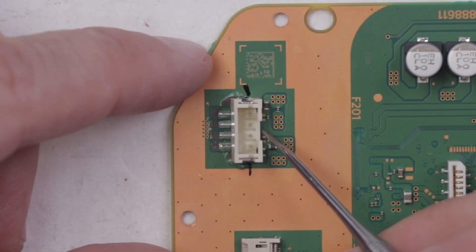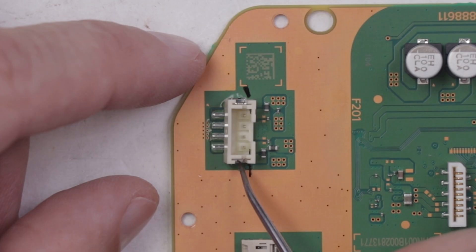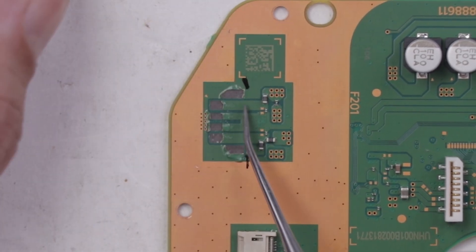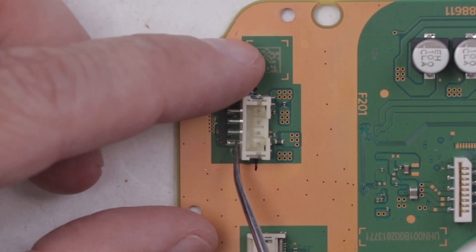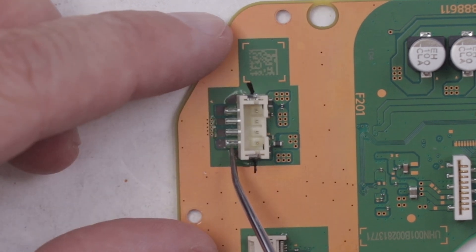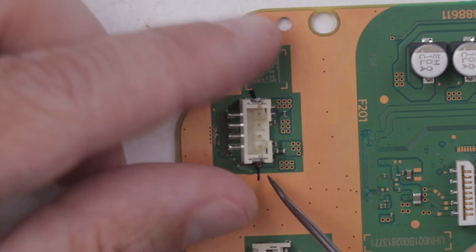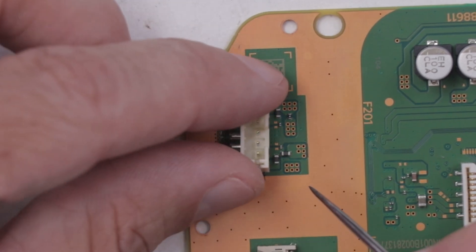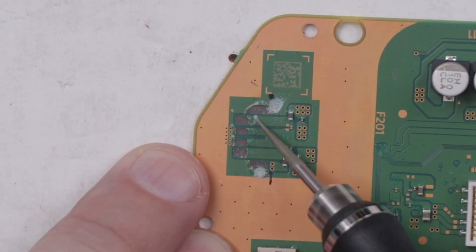The normal position of this connector is right about there, but since we need to make sure that we have a good mounting plane for each of these mounting pins, and in order to connect these four pins to the circuits on the board, I'm going to move this connector back right about there — right against this capacitor back here. That will make it so we can solder these pins right down to what's left of these traces on the board. Then we can use this part of the board to mount the connector to using the side mounting pins. Although that could be a problem because there is a little via, so I may need to solder this on a little bit crooked in order to avoid that. So I'm going to get this all prepped and then we'll do the soldering work.